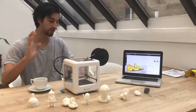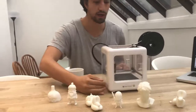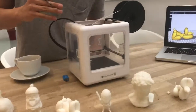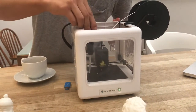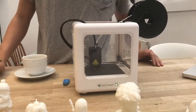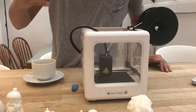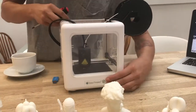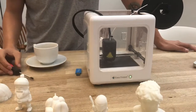Some things I really like: it only has three variables — the pen drive, flash, and micro card at the back — and one button. I think that's absolutely perfect and smart. But let's talk about some things that could improve. It's very hard to achieve optimal bed leveling, and if this machine is meant for kids, manually adjusting the bed every time they print will be quite hard. The UP Mini 2 from Tiertime does this automatically. This was quite annoying, and if someone like me with over a year of 3D printing experience had uncomfortable experiences with prints failing due to leveling, I believe this could be a problem for user adoption with kids.